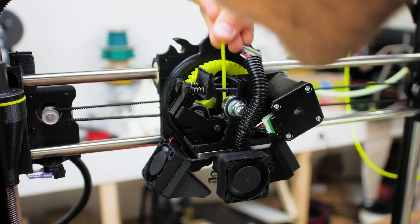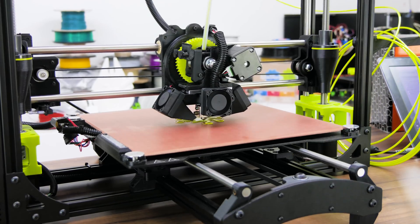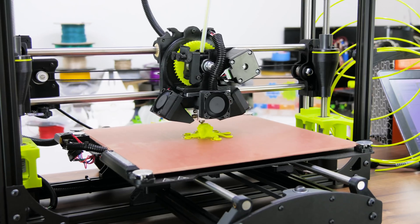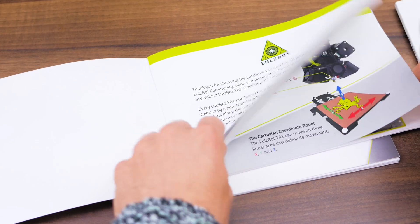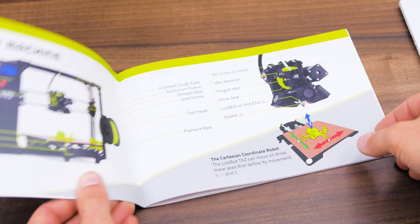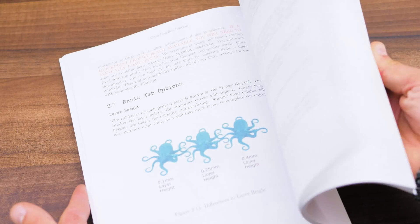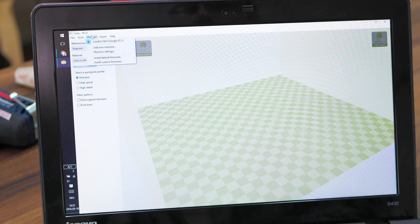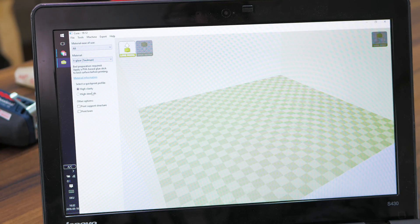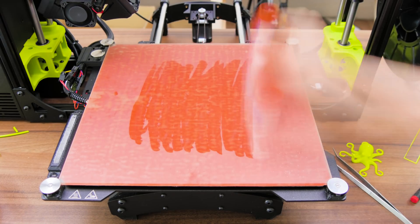Or you could take your time and refer to the unboxing and assembly instructions, then switch over to the operation manual, which takes you through all the steps up to your first print. Both of these manuals are super well put together — they were even entirely made with free Libre software. For anything beyond your first print, you can always refer to the full manual, which includes a full guide on servicing your printer as well as how to tweak every last detail of the print settings in Cura. The branded version of Cura comes preconfigured with a boatload of filament profiles with every type of material covered. You can use them with the exact filament they were configured for, or take each profile into expert mode and edit it to your liking. Depending on the material, you can also choose between fast, standard, strong, or high detail profiles, and Cura will even display tips — for example, should you need to apply a glue stick on top of the PEI bed surface to get the material to stick.